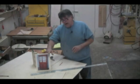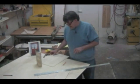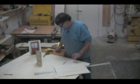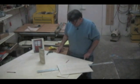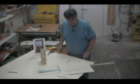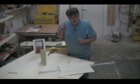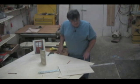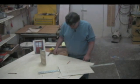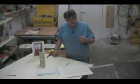Then I come to the bottom. Now remember, our raised panel was 18 3/4 inches. Actually it was 19 inches, but by reducing the bottom here to 2 3/4, remember I had said it was 3, what I've done is reduced everything by a quarter. So this bottom of the door is now 2 3/4, the top is 2 1/4.